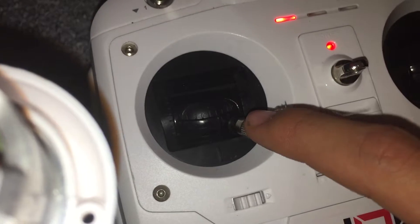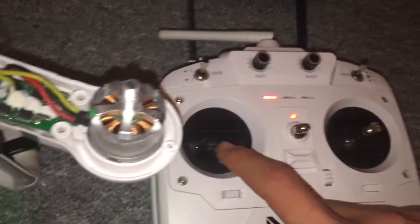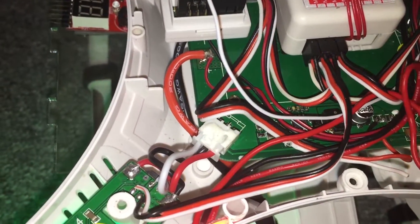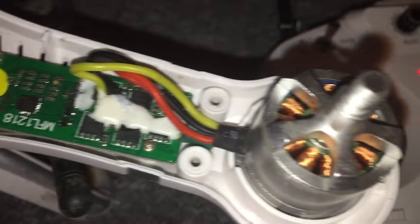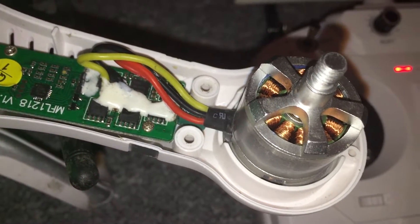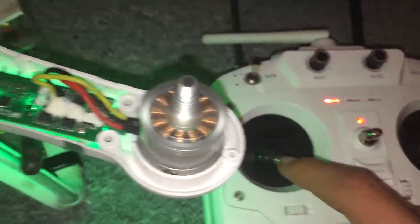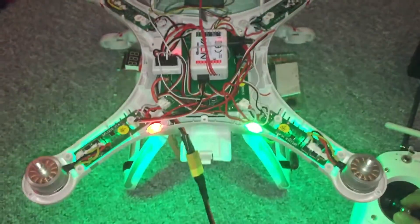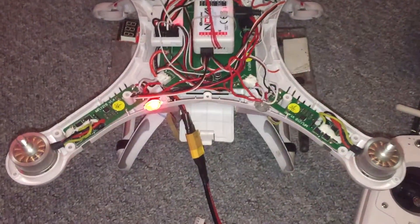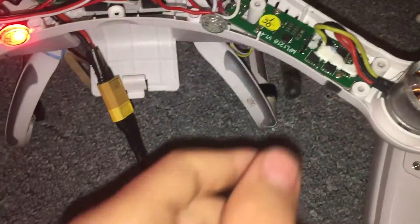So what you need to do is unlock your motors first. The motors are unlocked. Put the throttle at full. Find the ESC and plug it in. Two beeps — throttle down. The ESC has initialised and it's still unlocked, so if we move the throttle, as you can see both of them turn correctly. If you put your throttle at full, you should be able to hear that the motors are spinning at the same speed.